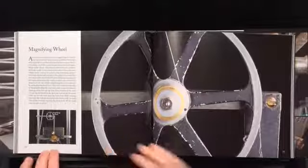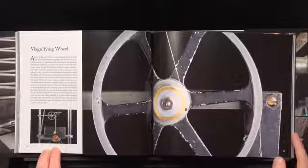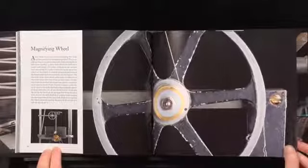The magnifying wheel further amplifies the motion of the summing lever. We noticed that the metal in this wheel was not magnetic, and so we thought it might be aluminum. We learned later from a catalog by the analyzer's manufacturer that they often used an alloy of aluminum called magnalium. They describe it as a very strong, white, and light non-corrosive alloy, and so that's likely what this wheel is made from. The idea was to get a very lightweight wheel.